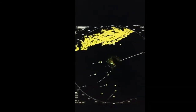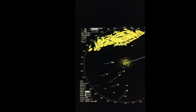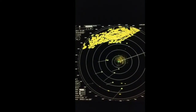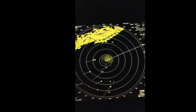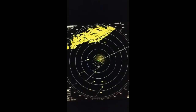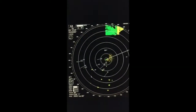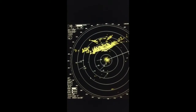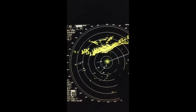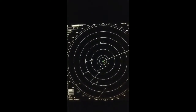This 'off' indicates range rings. We can use small range rings — there are options like four miles, two miles. Let's switch on one-mile rings: now one, two, three, four, five, and six range rings are shown because we are on six-mile range. We can change the range as well — for example, switching to 12-mile range, we can set rings to every two miles. Let's put it back to six miles.